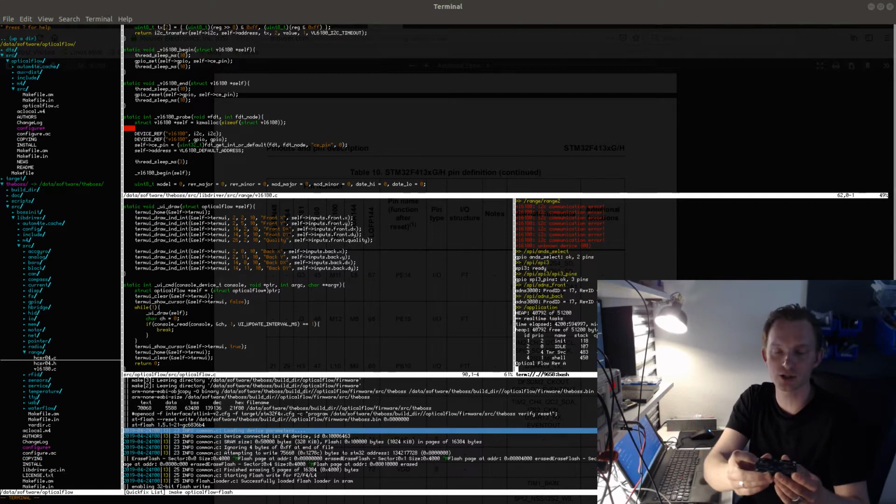And the fact that I had the voltage conversion chips here actually means that I can disconnect the other 2 chips from the I2C bus, which currently doesn't work at all, because the PB11 pin, I think it was PB11, is actually not available on this STM32F413. Instead, in the same place where PB11 was supposed to be, there is the VCAP output, so there is no I2C functionality on that pin, and therefore I cannot use I2C2 in this configuration. I would have to reconfigure it to some other GPIO, which I cannot do because that would involve redesigning the board. So what I'll do instead is just hotwire them all to the same I2C bus.